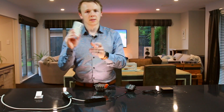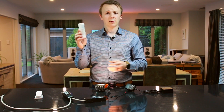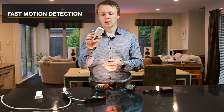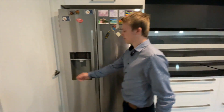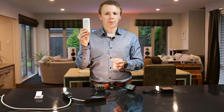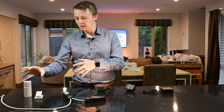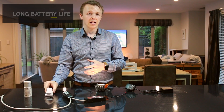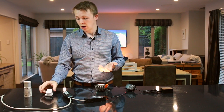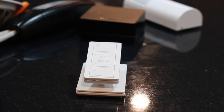There are also sensors and they work the same way — communicating on that radio wave frequency, and again battery powered, so they can be mounted anywhere in the home. They are really, really fast. This is why we love using these in all of our Lutron systems compared to your standard electrician's light sensor — these are lightning quick, they will pick you up as soon as you walk in the room. The batteries in these two devices are rated to last somewhere between eight and ten years depending on usage, and the keypads take a tiny cell battery which is very cheap to replace.